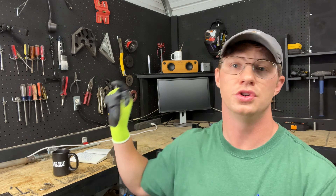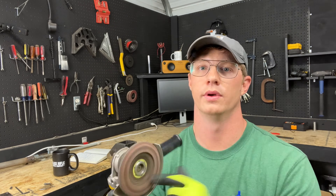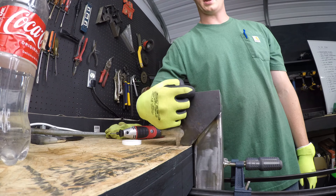I'm tired of dealing with this. Strike three — I spent a ton of time trying to remove this tap and nothing's working; everything's taking forever. I'm going to cut it out. The side of this jaw is half-inch plate, and I have the number seven drill bit drilled in the center of that plate. At this point I've got to bite the bullet — we're going to cut out the tap using an angle grinder with a cutoff wheel, not a flap disc. I'll swap out the disc and cut through the side to extract that broken tap.